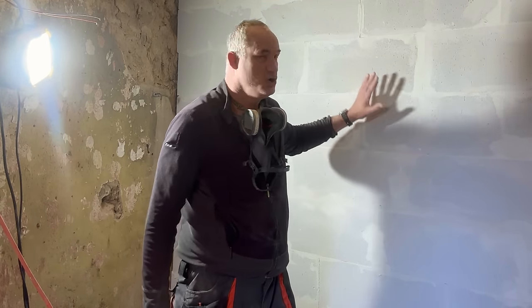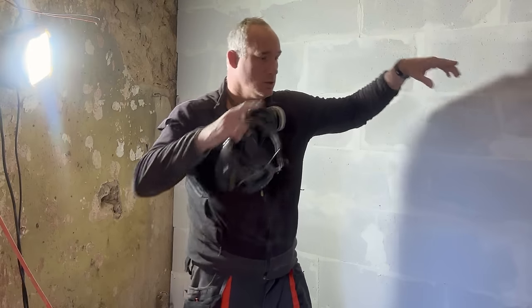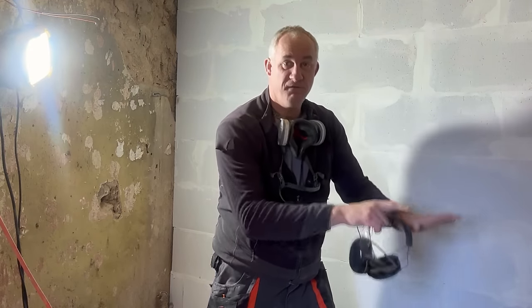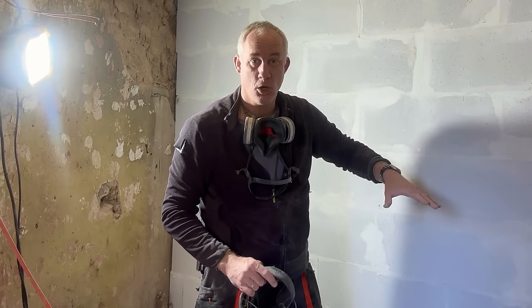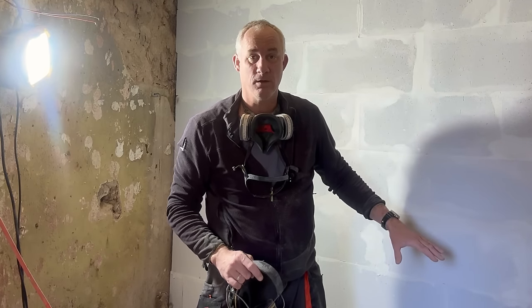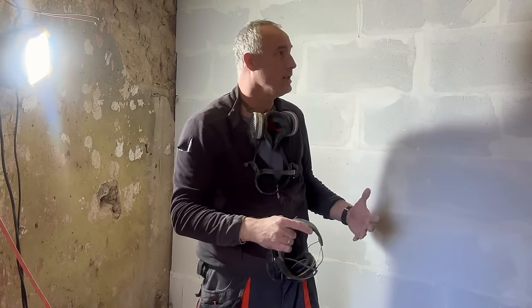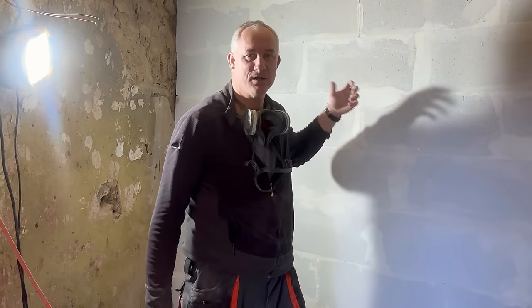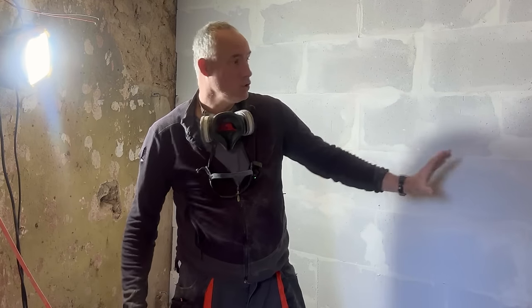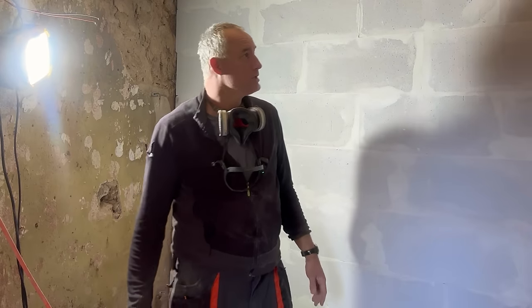And also the joints between this wall, my both exterior walls, plus the walls from the shower cabin, plus the floor in the shower cabin, will be tied together with this fiberglass mesh cloth that will be embedded in the first layer of rendering. That will provide me with a water leak proof seal, and also it will provide strength, because it literally ties everything together. Everything will become one, and that will make everything very, very strong. I've been thinking long and hard about strengthening this wall, but that tying in to these walls will make this wall structurally really strong.